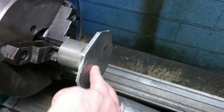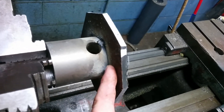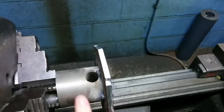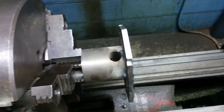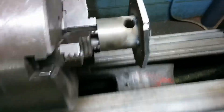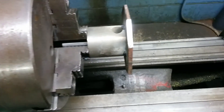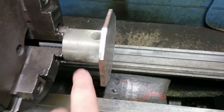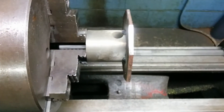Where I'm at now is I need to make the plug for the bottom. I took a chunk of sheet metal, cut it out roughly circular, and tack-welded it to this boring bar head project I never got off the ground — it was sitting in the scrap. I tacked it on to make it run true so it spins pretty solid. I'm just going to come in and turn that down to make it fit. I don't need to be that accurate since I'm going to weld it anyway, but I could sit there with a grinder and make a whole load of dust and be a mess — so I figure I'll do it this way.